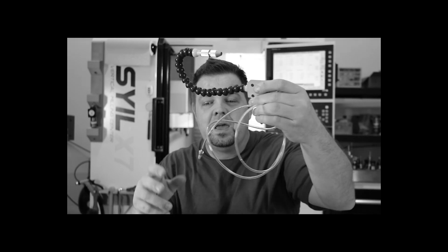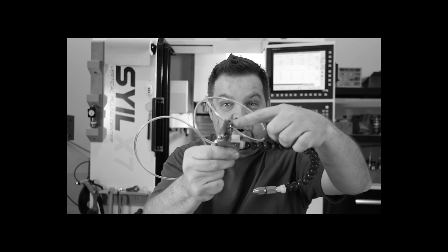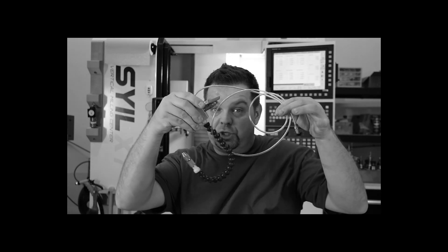There are really two types of coolant sprayers. You have something like this that you can get on eBay for 20 or 30 bucks — this uses Bernoulli's principle. A line goes down into a bucket of liquid, an airline goes in here, it sucks up fluid and creates mist — highly atomized fluid of your choice. Then you have something like the Fog Buster, which is a mist-less coolant sprayer. The fundamental difference is that the cheap version doesn't pressurize the liquid. What makes the Fog Buster unique is that it runs at a very low pressure — 10 to 15, maybe 20 PSI — and it pressurizes the fluid in the canister. That's why they call it the mist-less coolant sprayer.